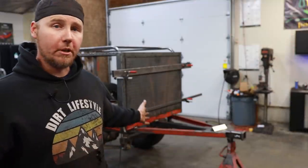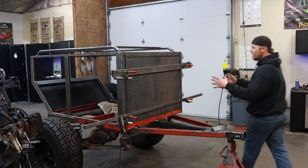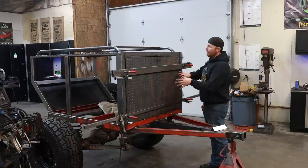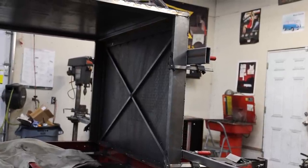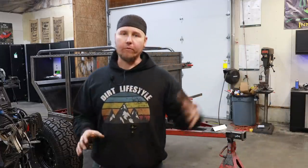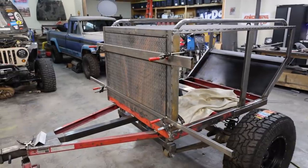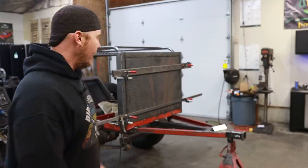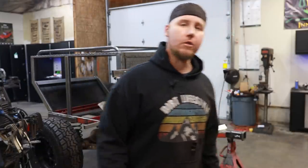As you can see, the door is pretty much scabbed together. I've got the frame in place, evenly spaced everything out, and used a ton of tacks to hold the skin on. I want to finish making this door functional before I finish-weld anything, because even though I have a bunch of tacks, I could still cut all the tacks much easier than cutting complete welds. And if anything needs to get moved or shifted, it's going to be so much easier moving forward. So now what I need to do is build a hinge system.